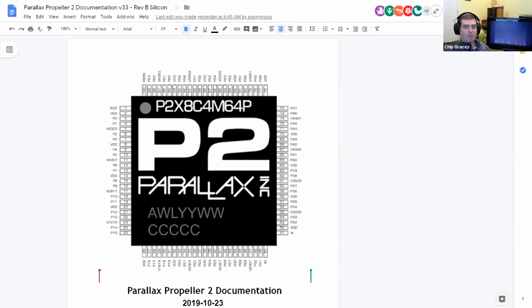So it's designed to be really well bypassed, but fortunately it wound up taking a lot less power than we thought it would. In the end, we added clock gating into the design, so for a lot of uses, the power is half of what it was on the Rev A, and I'm talking about the Rev B silicon. So the part really doesn't get that hot, but it's designed to wick heat away very efficiently and receive high current power supplies, and bring them onto the chip with very low local drop on the die.